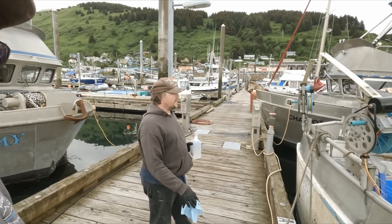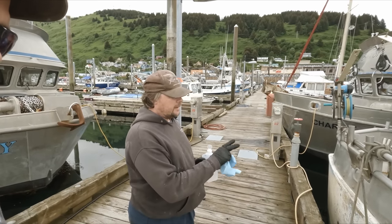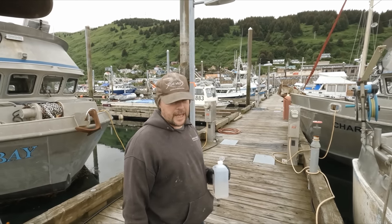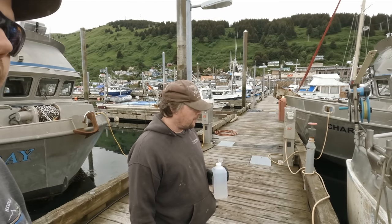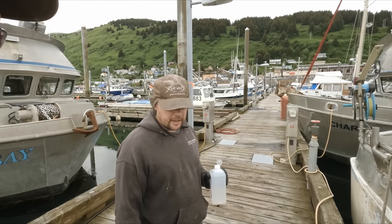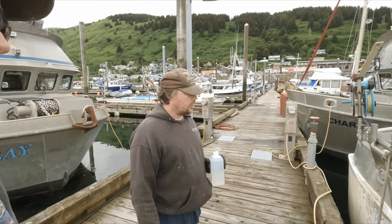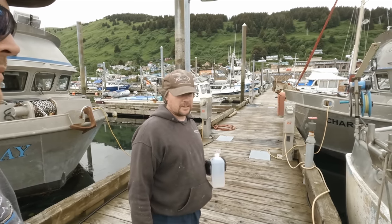Yeah, the reason we initially set it up the way we did is that we didn't have steering control on the boat, and so stern hauling, even if it's windy out and rough, that line will pull you through the water. But it's really, really hard to steer back here. You basically can't steer if it's windy. You just end up in the trough and you're kind of at the mercy of the ocean. Your line gets stretched out real far. It's kind of a hassle.